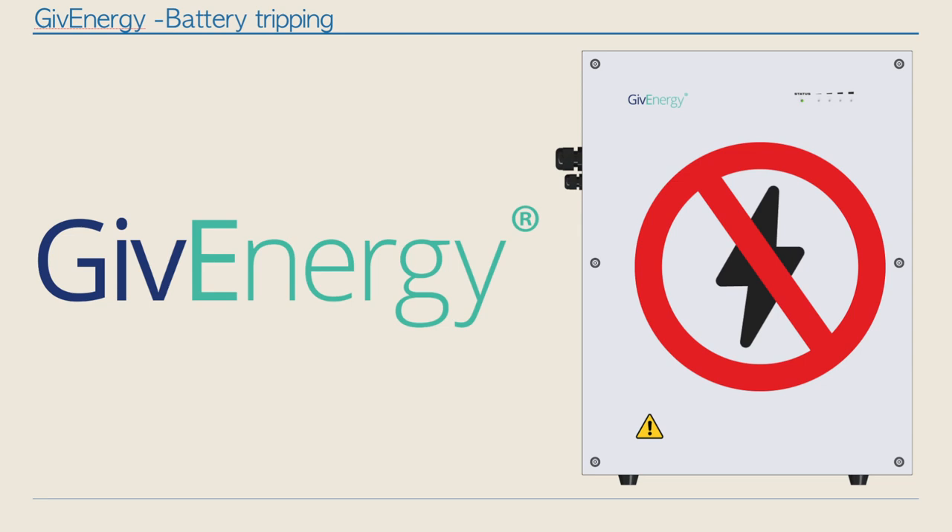The reason I'm raising this is that when the battery trips, I don't receive any alerts or notifications. It's only when I look at the app and notice the battery isn't charging or discharging as expected that I realise it's tripped and go check the fuse. There were times when the battery was tripped and I was out of the house and couldn't do anything. So instead of charging or discharging, we had to export or import power from the grid. This has obviously impacted some of the numbers for May. Overall it's still been a fantastic month, but we could have done better without this issue.